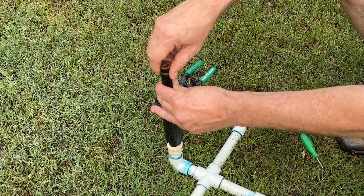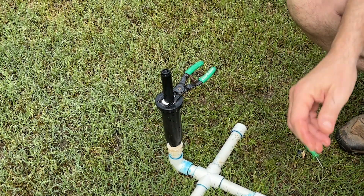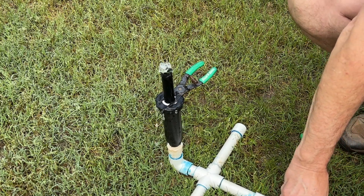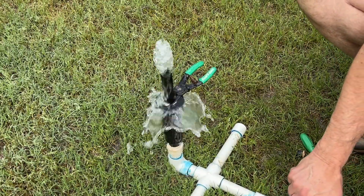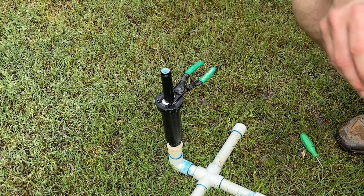Come and remove all the nozzles that we are flushing out. We're going to take and toss the old nozzle and filter. We go back to the timer and turn our zone on just enough for maybe 10 or 15 seconds, just to flush out any debris that's down in there, then shut it back off and grab a fresh nozzle and filter.